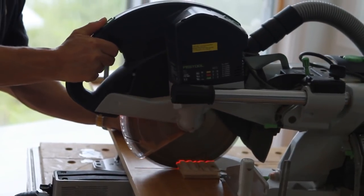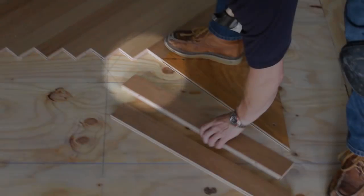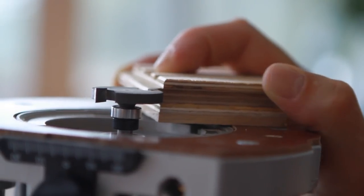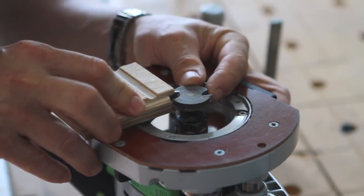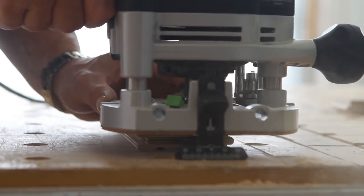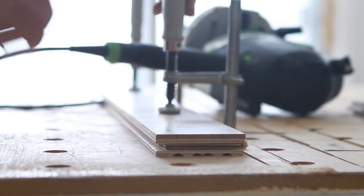Again, make sure to chop off the ends of the tongue. In order to make a herringbone pattern, your flooring slats need to have a groove on each end. Luckily, you can add a groove on the ends you just cut with a router. First, use a groove in one of your slats to adjust your router bit, then clamp a slat to your workbench and run the router along the end to create the groove. Then groove the rest of the slats.